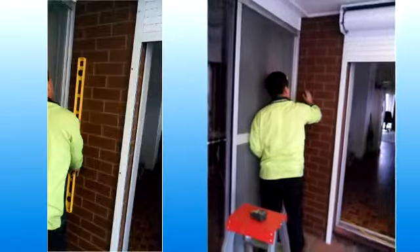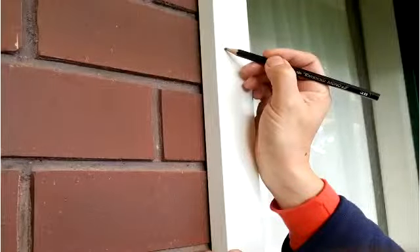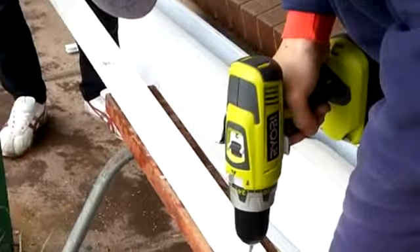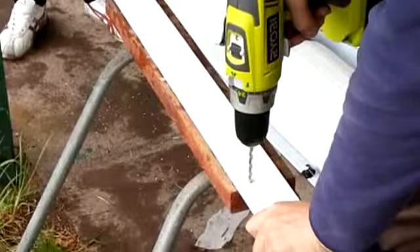The middle of a brick is the best place. Step 2: draw the X mark on the guider over the X on the brick. Step 3: make 3 or 4 holes along the guider depending on its length. Use the 5 mm bit for the inside hole and the 10 mm drill bit for the outside one.